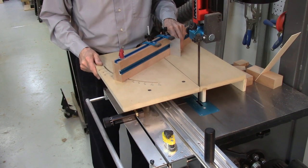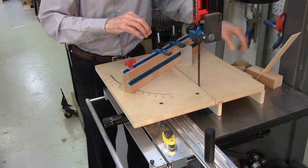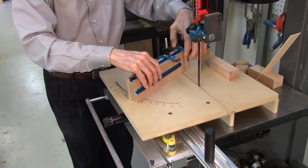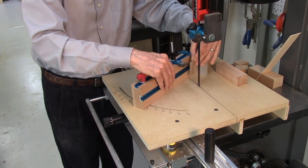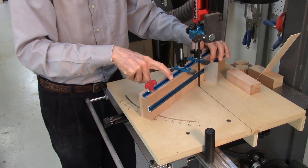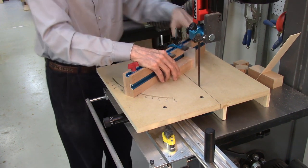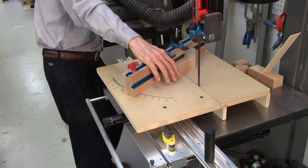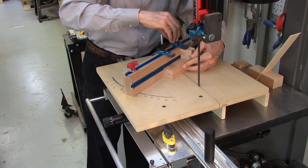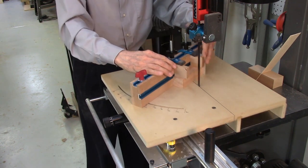To use this version, first slide the jig onto the AccuSlice rails, adjust the angle of the cut, and adjust the position where you want to cut your wood. Next, set your stop so the blade doesn't go all the way through into your fence — I use a piece of 100 thousandths inch thick wood, adjust the blade so it just touches that, then set the stop. Attach your wood and clamp it in position, pushing it against everything to hold in place, adjusting the clamps with small blocks of wood and making sure everything clears the bandsaw blade path.